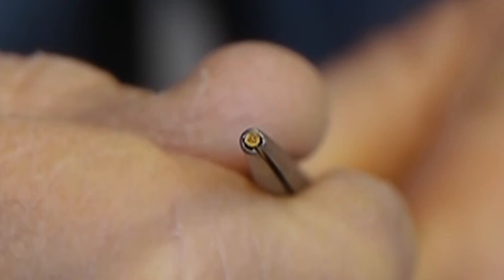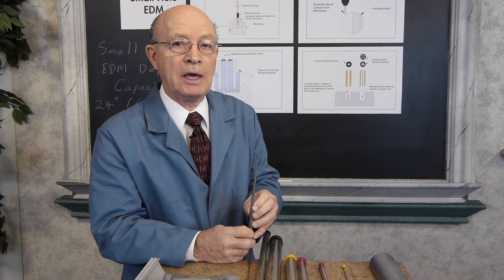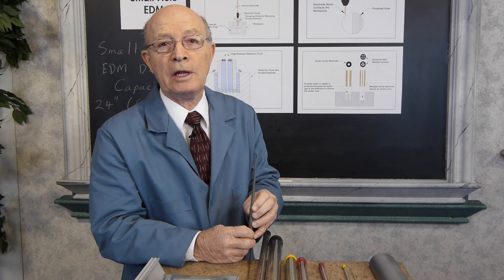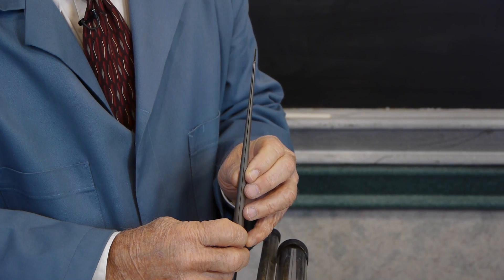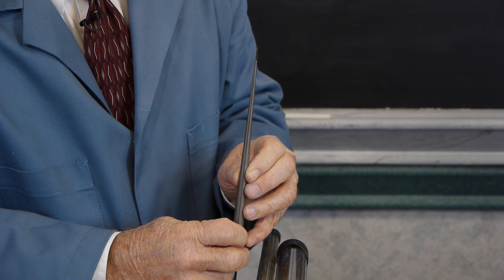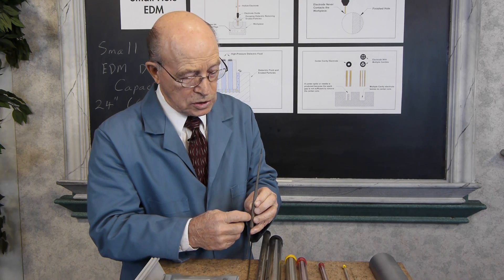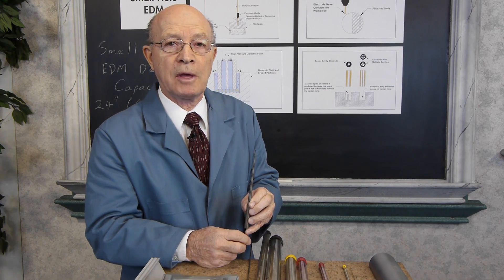Just take a look at this small little hole where we put this electrode in. The print called for this cone shape to be EDM'd out of a part. We had to put a hole in there to start, so we used a small hole EDM to put this hole inside — notice how small the opening is. And here you can see the long cut. This is the slug, and this is the part with the long slot, with the wire leaving the slug behind.